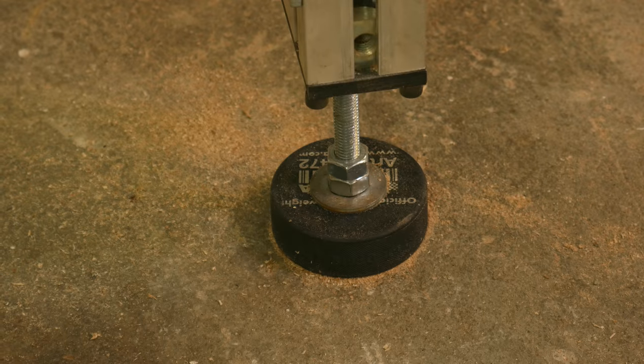The fence setup has a larger unit that is geared down with a belt and pulley configuration. And it has some heavy duty linear rails. I made this custom end unit for tensioning and tracking.